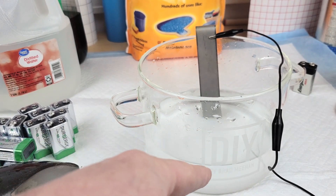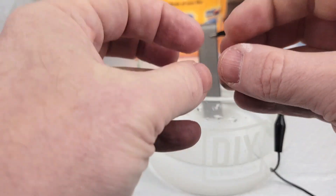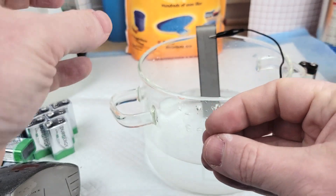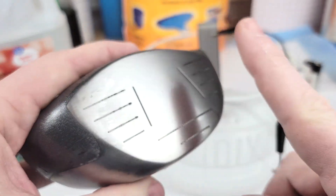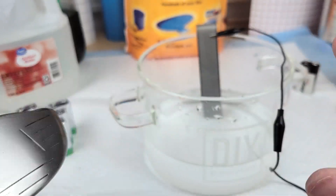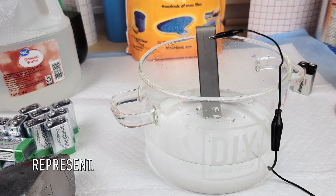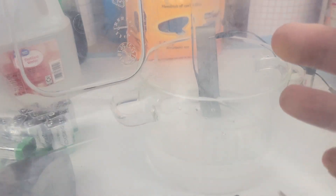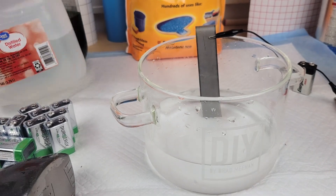As current flows through this electrolyte, the water molecules will break up into hydrogen and oxygen. Oxygen is what's going to attach to the surface of the titanium and change the color. The hydrogen just goes in there and turns into water vapor when it attaches to another bit of oxygen. That is my Grand Rapids public school education explanation of what we're doing today. Off to the side, I'm going to have another container just for rinsing — fill it with a little distilled water.